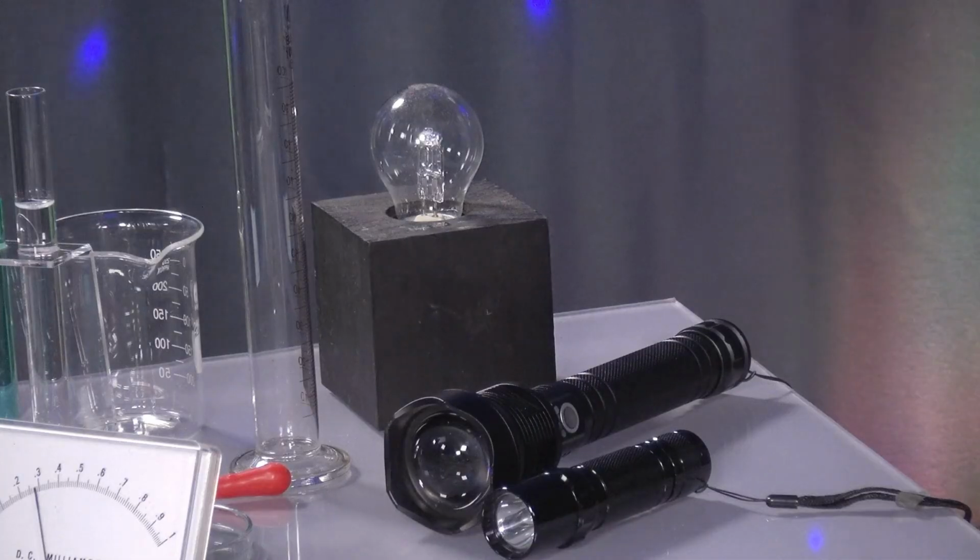And when I light up a large area from an illuminant, then it is clear that a smaller amount of light falls on each part of the area than if I light up a smaller area. That is why we say at our workspace we have to have so much lux. In an operation in a clinic we need many thousand lux. In a toilet we only need 50 lux. We know where everything is. In the office you should have around 1,000 lux, and that you measure with such a device, like I have here.